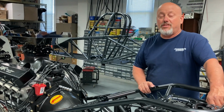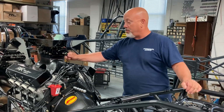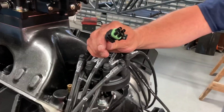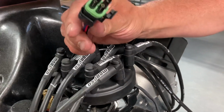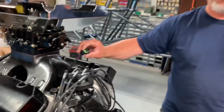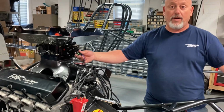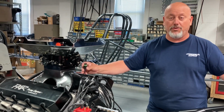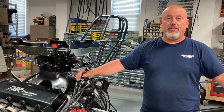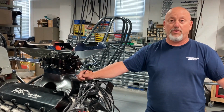And as much as possible, I take pictures of things like weather pack connectors, so every car is wired the same. This is for a digital delay dial board, but every digital delay for the last year and a half, probably at least, if not longer, has these 4 wire colors in this order. So if your dial-in board was to fall off your car and break, or somebody hit it and you needed to borrow somebody's, if I did it, it's going to plug in.